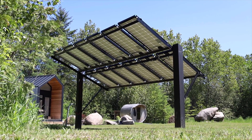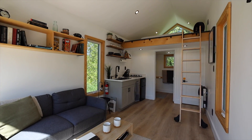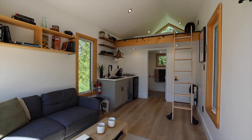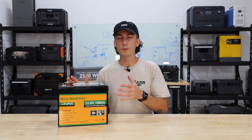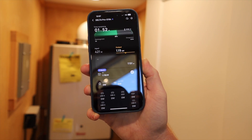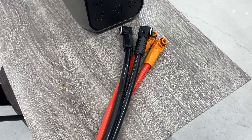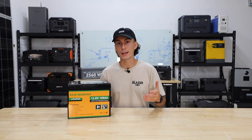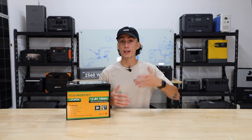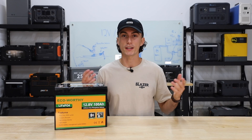When you start applying a small 12 volt battery to a solar setup, though, you're typically wanting a higher wattage draw — running something like a coffee maker, a fridge, lights, and small appliances. For a long time, 12 volts was the option for systems like this. The problem is once you get to high wattage — like 1500 watts — you're going to need pretty thick cables carrying a lot of amps. That ends up costing a lot more money because the thicker the cable gauge, the more it costs. It also gets bulky with multiple thick cables.